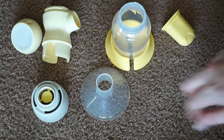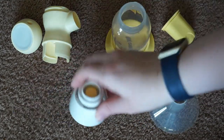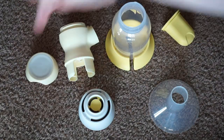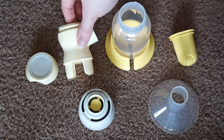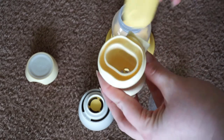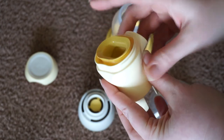You have that right there. You have your typical flange, but this is your new valve. This is a connector body, this is your connector cap, and this is your membrane — so it is pretty different. What you're going to want to do is take a connector body, obviously make sure everything's clean, and slip the membrane down inside here. You just want to make sure that it's nice and flush.